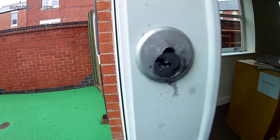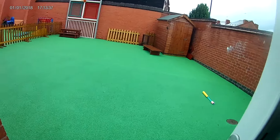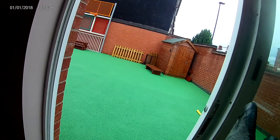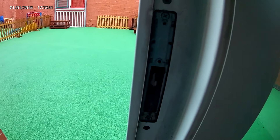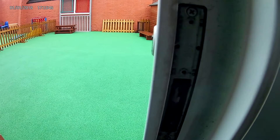This is the outside of the door and that's the cylinder which I've drilled to basically get the door open. Once I slid the door open, that exposed the gearbox here. Basically what you need to do is unscrew those tiny grub screws there and there, and then it's a screw-in rim cylinder — you just unscrew it once you've taken those grub screws out.